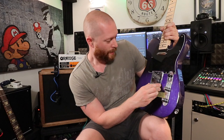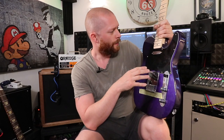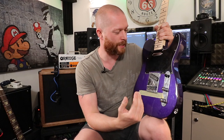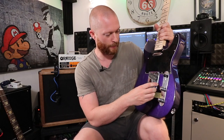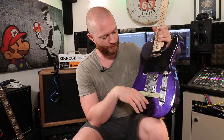I think that's the easiest approach. I don't really want to get the router out — it's quite difficult to protect the body, and the tear-out you get means you'd see the packers, which is more noticeable at the neck joint than a slightly off-centre bridge around the scratch plate. So I'm going to put some dowels in, glue it, leave a comment and let me know what you'd do — wish me luck.